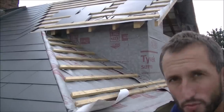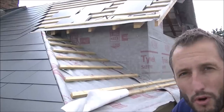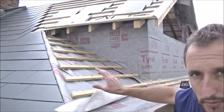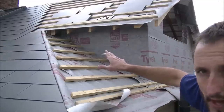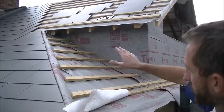If you look at the roof, you may recognise that I've actually whipped a few of the slates back off. I came across a small problem and realised I had to redo a few. I also forgot to put on the felt support tray. For the sake of taking a few slates back off, we'll do it properly. There was just that little cut slate I had to do on the end, and on the end of the hip I worked out I didn't need to do the cut - I can put a whole slate on it.